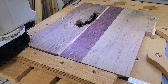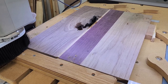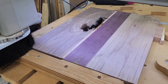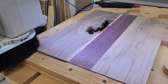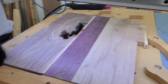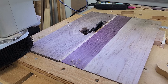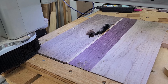48 hours later - continuing with the cursed project, the one where everything's gone wrong. You can see the resin there on the top. I'm going to go ahead and mill it just to flush the boards out, clean up all the resin, and hopefully clean up those places where I spilled the hardener too. I'll do as little as I can on this side to just get it down - going a tenth of a millimeter at a time, then do the other side the same thing.